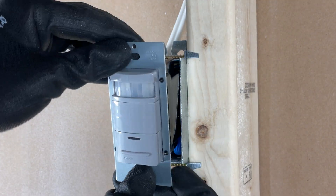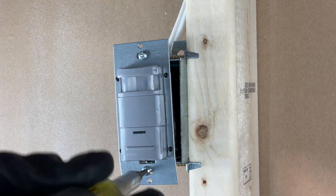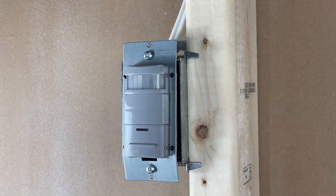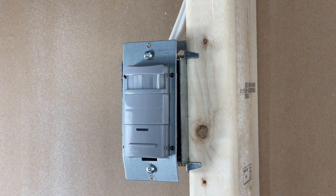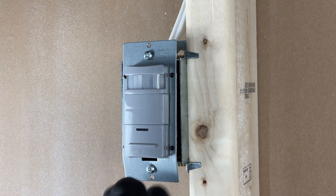Verify which way is up. That's sitting pretty nice. If you like, you can put the cover plate back on — I'm actually going to leave this as is. Maybe I'll source a great cover plate in the future, but I kind of like this look for a laundry room. So let's go ahead and turn the circuit back on and test it out. If all goes well, it will work like a dream — open up the door, walk by it, and it should turn on your light. Depending on where you set that timer will determine how long it stays on. Hopefully you've learned something today about how to install an occupancy sensor. Thanks for watching another video with The Electrical Guide. Be sure to like and subscribe.